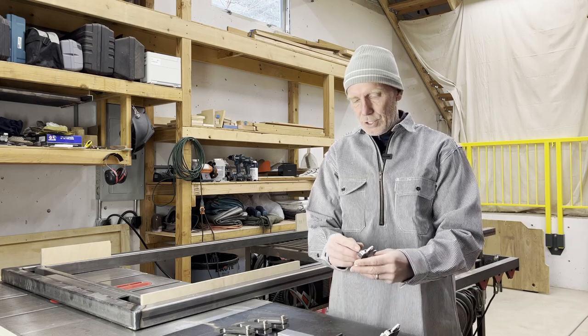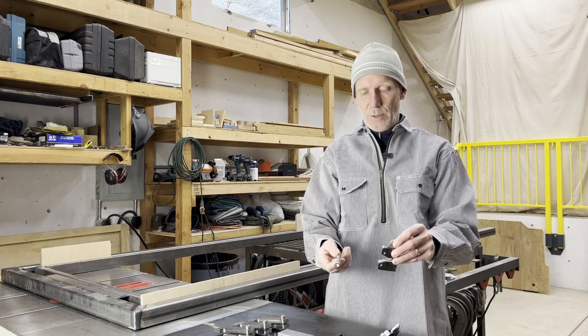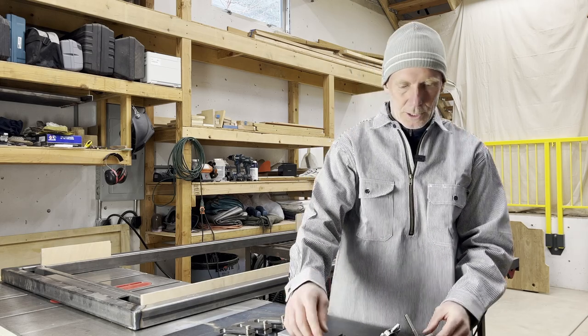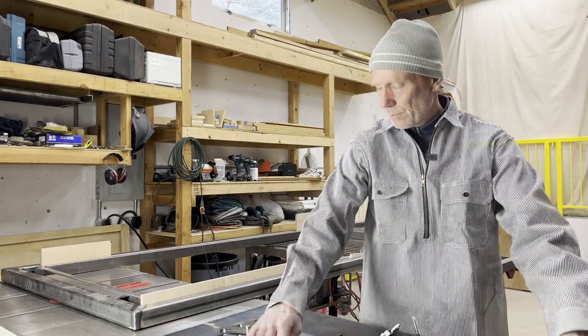I came up with a latch, and the latch is sort of like it's going to captivate a 3/8 inch bolt, two 3/8 inch bolts that will fall into a little like a guillotine with a catch on it, and those will be linked together with a linkage that has two little clevises that will hold it together, and a stainless steel pipe that will hold it.